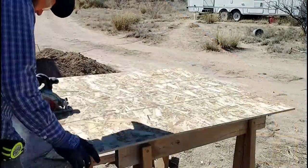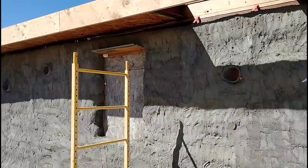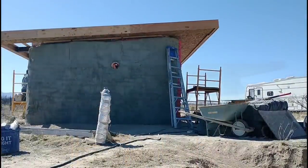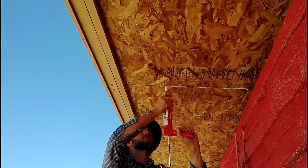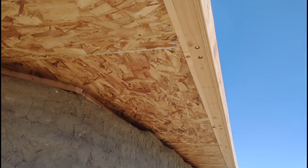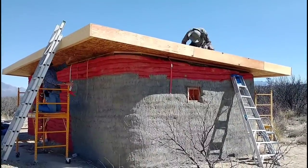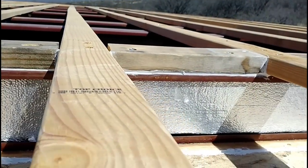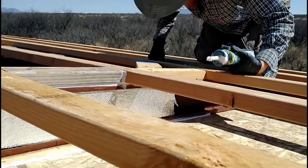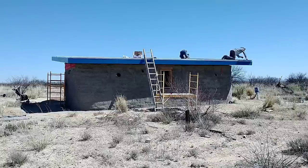We chose to use OSB for the soffits mostly as a cost consideration — it's inexpensive and Kyle isn't too picky about aesthetics, he just wants it to be functional. We'll paint it to make sure it lasts and doesn't deteriorate. With the soffits in place, we wanted to take a little time and seal everything up one more time — make it as bug-proof and airtight as possible, especially while we can still access it from the top. I'm working from the bottom to caulk the cracks, and Kyle also got up top and sealed things from up there. It's really nice to have these eaves done. You can also get a good look at the blocks we put in between the purlins on top of the metal beams to seal in that space and further seal in the roof cavity from the eaves.